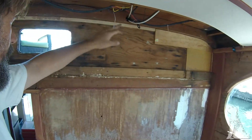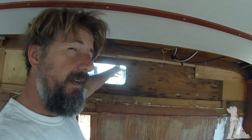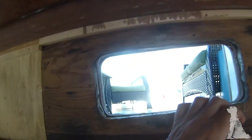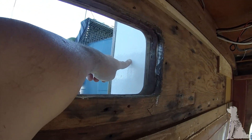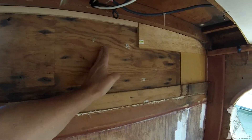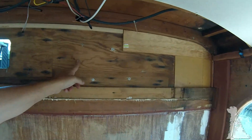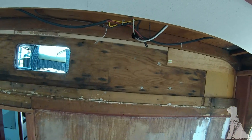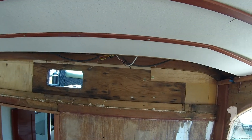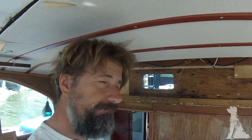I'm removing it and putting a much larger window for much larger visibility and more ventilation - also easier to hand things up to the helmsman at the upper helm. I'm going to reduce the size of the upper helm so I can put a much larger window here. It's going to be 10 inches high by 36 inches wide, and I'm going to make the window with a mahogany frame and sliding tempered - or at least hardened - glass. Just finished designing it and I'm pretty excited about it.